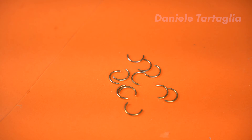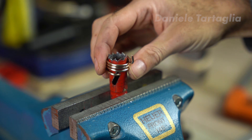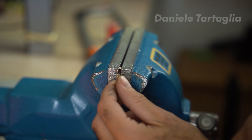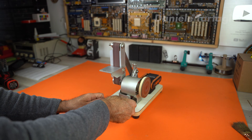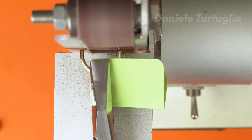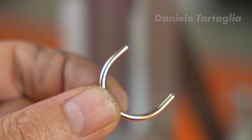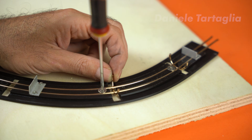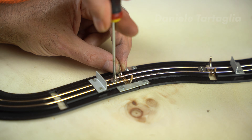I make plenty of them since there are three wire forms in total. The key is to straighten the rings and flatten the cut ends using a small DIY vertical grinder — after soldering, this would be much harder to do. Once the half rings are ready, I insert them from below into the dedicated slots. They fit perfectly. Just tighten the screw to lock them in position.